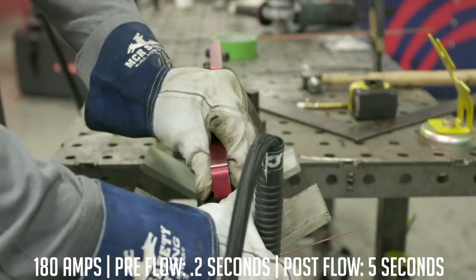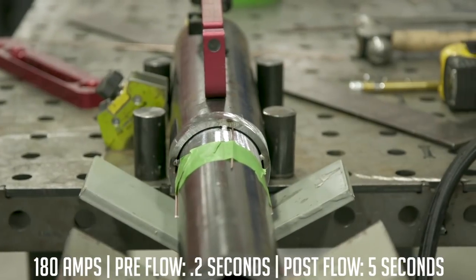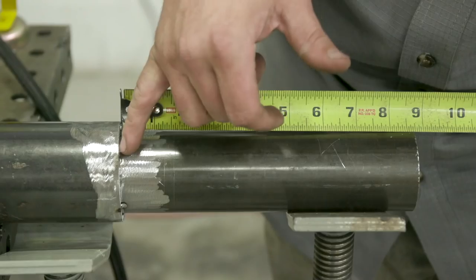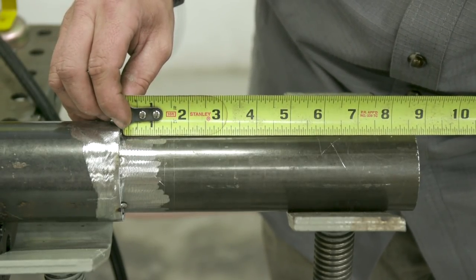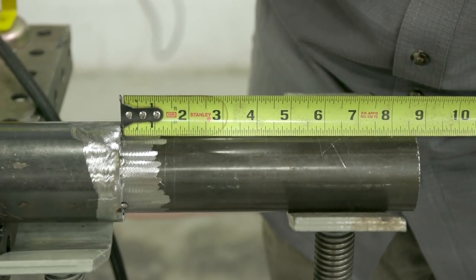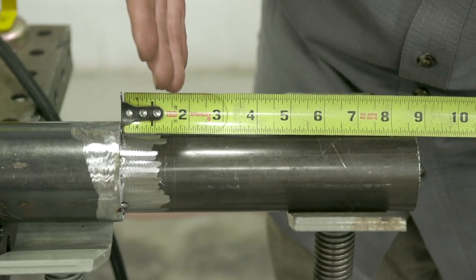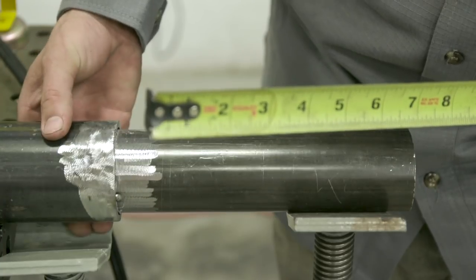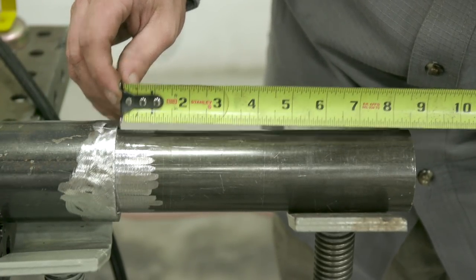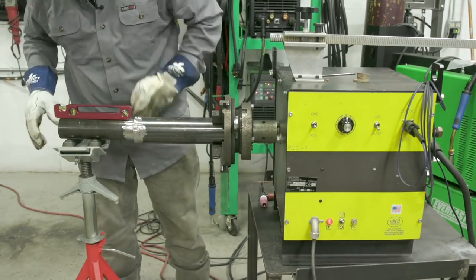I usually tack at a triangle — tacking at three, nine, and twelve. We've got to make sure we're maintaining eight and eleven-sixteenths. We're at eight and eleven-sixteenths on the money. Sometimes you're allowed plus or minus an eighth inch. I usually check three spots: check one, rotate it a little bit, check it, rotate a little bit and check it. That looks good. We'd normally call an inspector over, but we're practicing, so we're going to go ahead and chuck it up and weld her out.